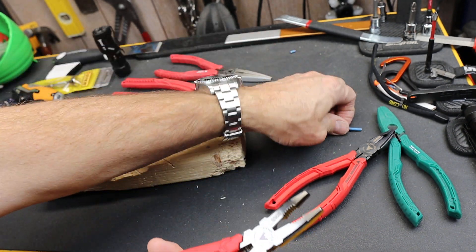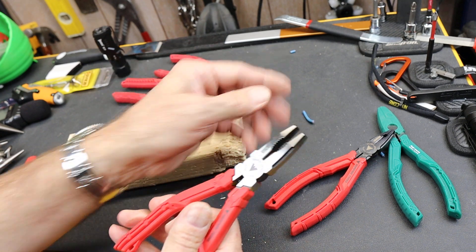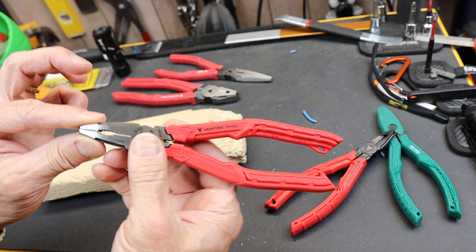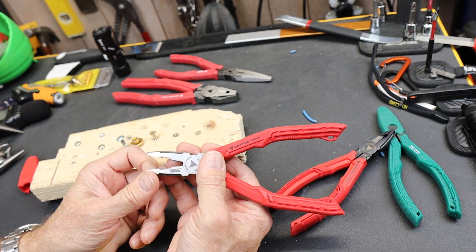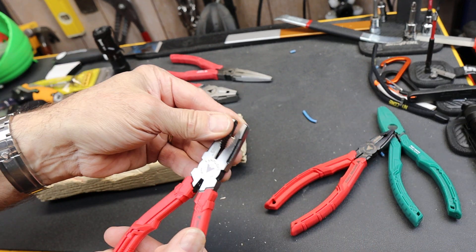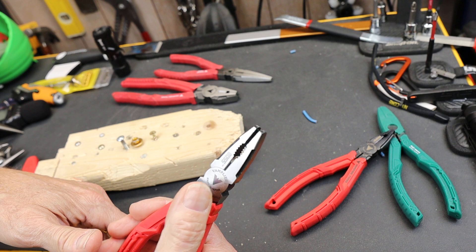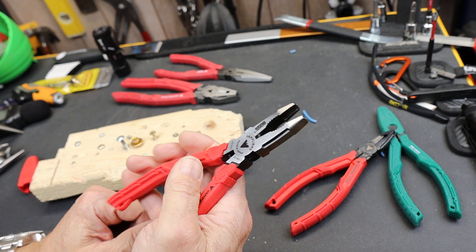As far as cutting, you can cut heavier wire and small steel wire. This is the revised version — it was revised one year ago, in November of 2022. A newer version came out and that's this one that I'm holding. You can cut up to two millimeter stainless steel wire with this one, steel wire up to 3.2 millimeter diameter, and up to four millimeter copper. So that's pretty substantial, whereas the Brute is generally limited to much smaller wire.